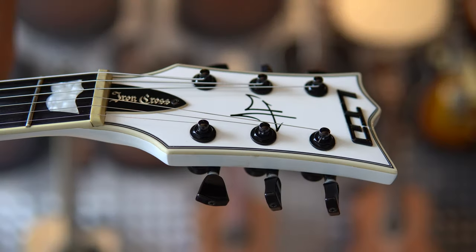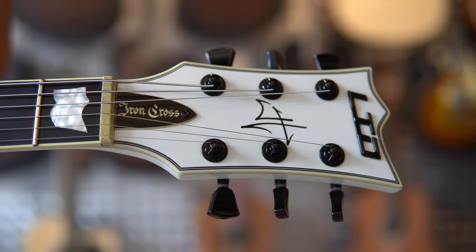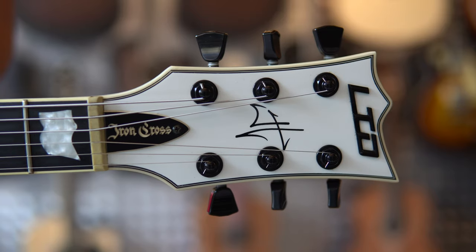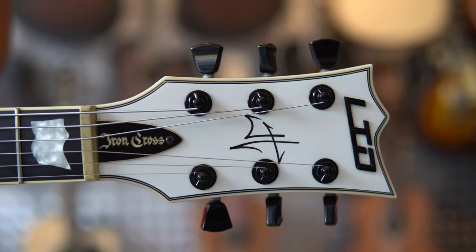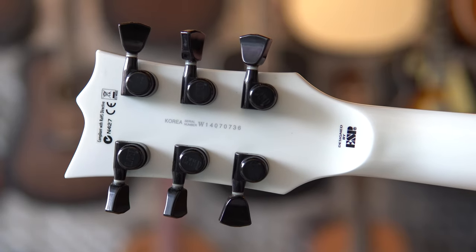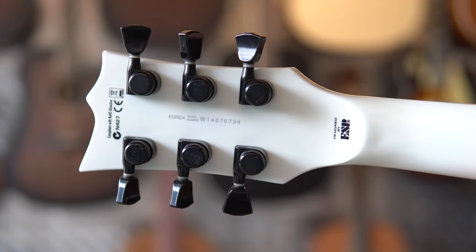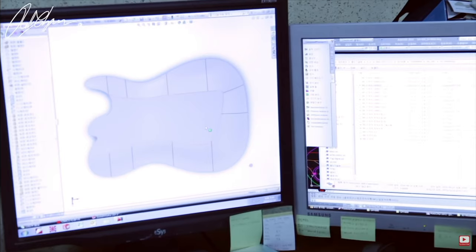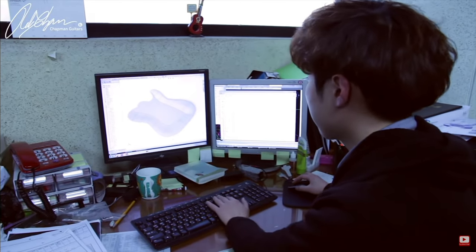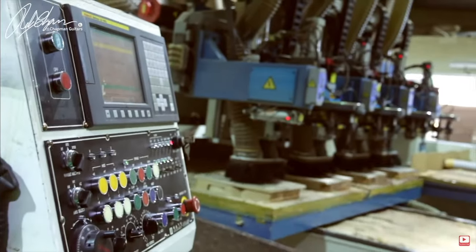First, you gotta supply and select the proper materials. The LTD is made out of mahogany, maple and ebony, replaced by Makassar ebony in later models. There are different grades of wood material depending on the class of instrument that you want to achieve. Then there's the CNC routing process, which stands for Computer Numerical Control. The short version of it is a machine that uses a 3D drawing as a map to move the cutting tools or CNC routers through a pre-made pad, getting consistent results in mass production.